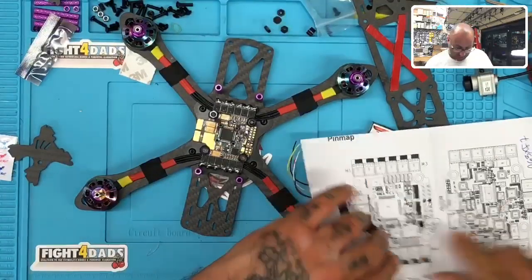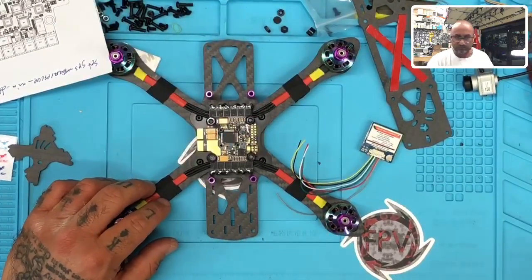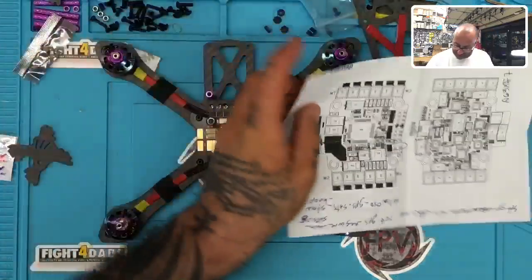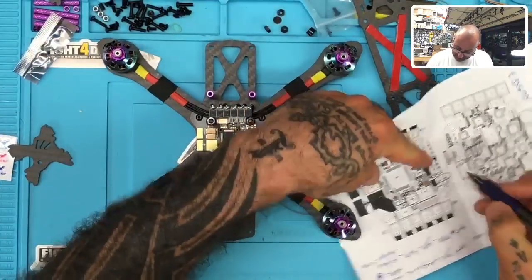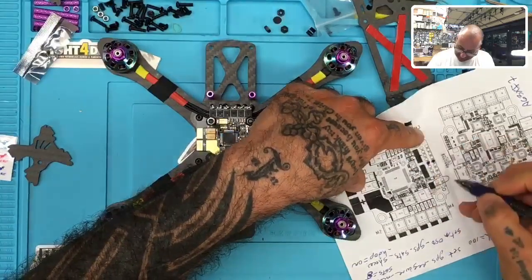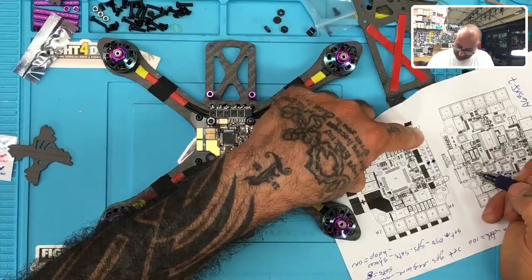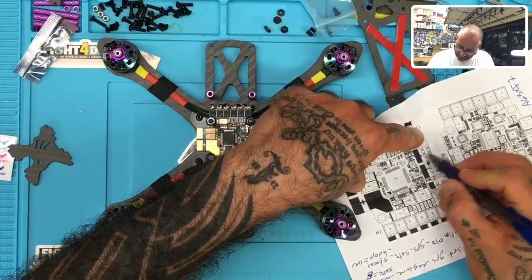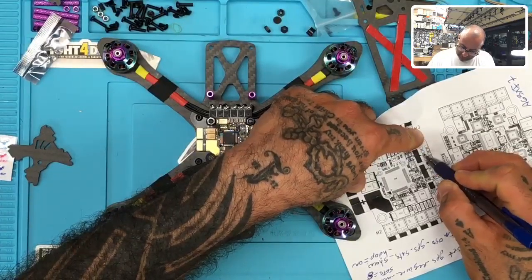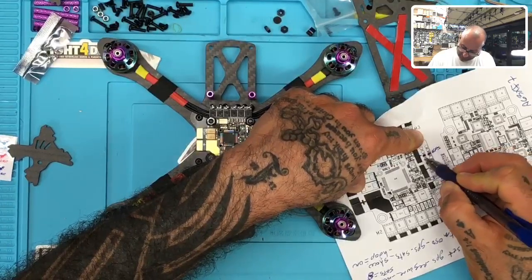All right, so we need to go put those on. Let me get the soldering iron on, get everything good. We've got a 5-volt, so it's limited to 5-volt on the GPS. So we can jump onto this here, and we can go the ground here. Then we've got open ports on 5 and 6. We're going to use 5 for GPS, and we'll use 6 for the DJI.